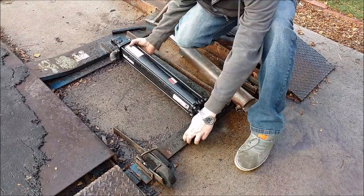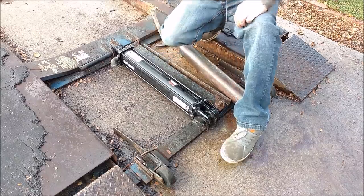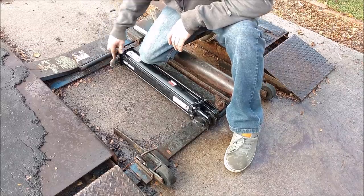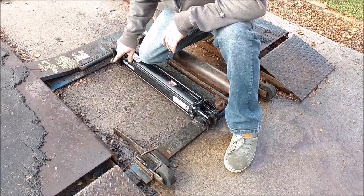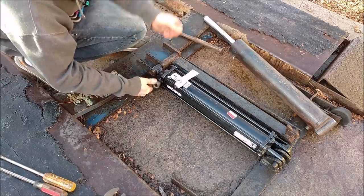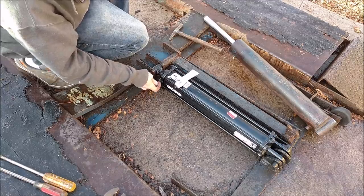Now just a matter of pinning it in. See how well we lined them all up — there we go, it went in. Then just pinning the top. This breather port is what got water in it before because it was just this open hole — anything sprayed on it could just go in and fall down there. So I'll put this street elbow on here so water would have to go upwards, tighten that down facing down, and put a plug in there with just one small drill hole since that side is unused. The regular port will just attach and pump up and down.